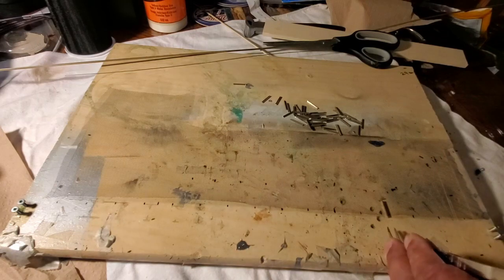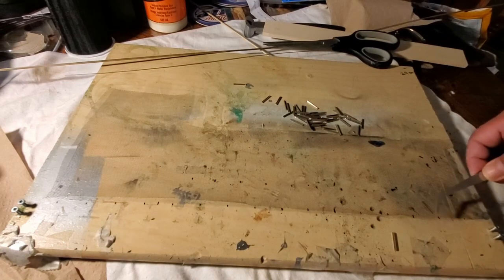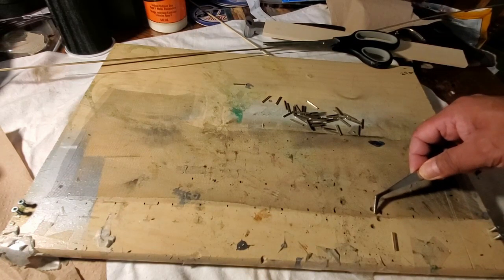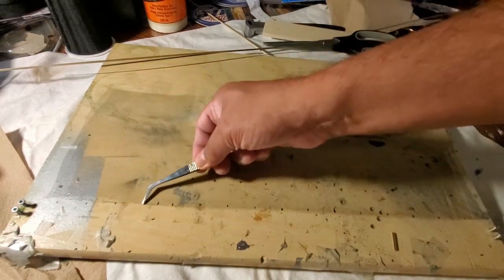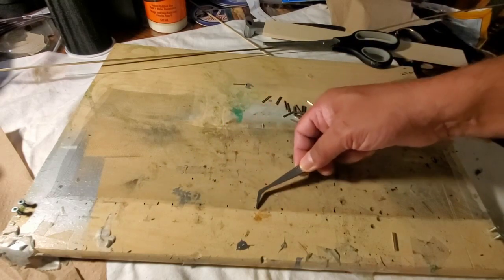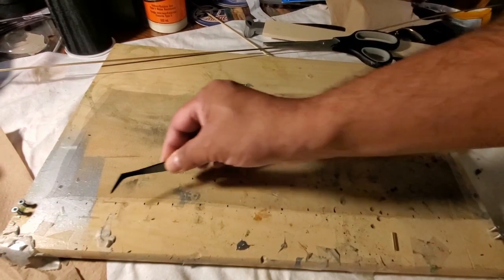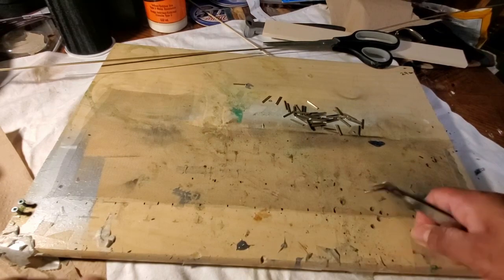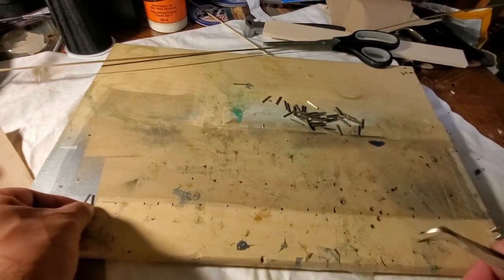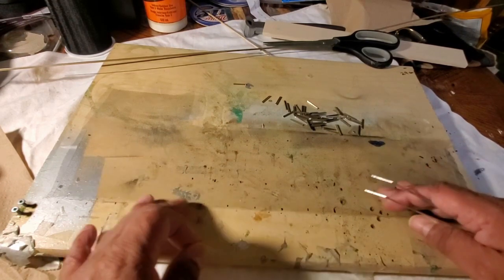So what I've also done here is, you'll probably notice that I've got some markings over here on the wood. I've marked a gap of 2.5 centimeters apart for each marker. The reason I marked a gap of 2.5 centimeters each time is that way I can just place these vertical rods right at that spot and put some glue, and I know that I've got exactly the same spacing each time. All right.